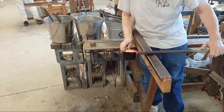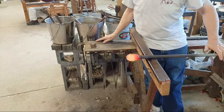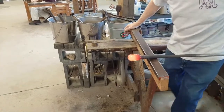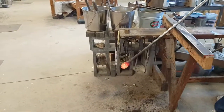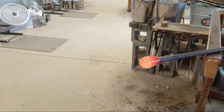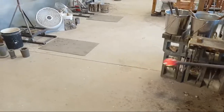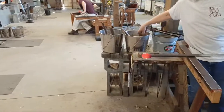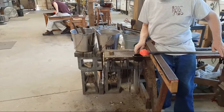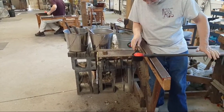You saw when he brought it back from the furnace first off that it was really kind of wobbly. There's a lot of motion to it. So he stabilized it, again with the trapped air, and we'll watch the bubble increase in size within that gather of clear. The block can also be used to kind of chill and shape the glass after you've introduced some air.